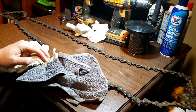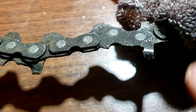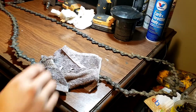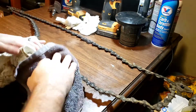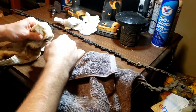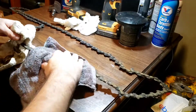I've got a 12-ton press outside and I've been thinking of ways to utilize it to put a little pressure to break them. This one absolutely wants to be stubborn, so I was thinking about going outside to the press and gently pressing on it so that once it breaks it'll be nice to me. Then once broken, you can add lubricant and it'll just be good because it ain't going to get any looser. So going through that process - finding if I can hand-break them and going from there. See that one right there? Just broke free, and now it just turns wonderfully.